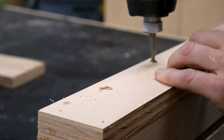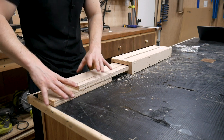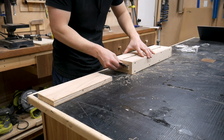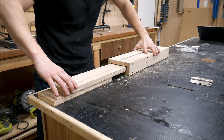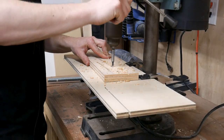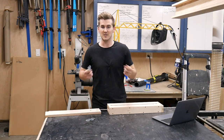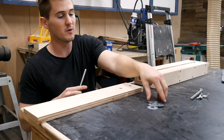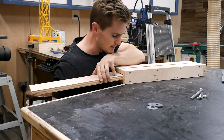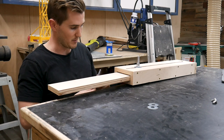When building this box, I wanted to make sure the three-quarter inch plywood sliding in and out wouldn't be too tight, so I used a piece of three-quarter inch as a spacer and added just a little bit of thickness to the width of the side pieces so there would be some play. The last thing for this piece is to finish building the sliding mechanism — I'll cut it at the table saw and drill a hole at the drill press to accept the lag bolt. I have carriage bolts and washers to protect the wood, and since I don't have any more star knobs we'll be using wing nuts. I'm going to feed the bolt through the underside, slide in this piece, and having two of these will prevent wiggling.